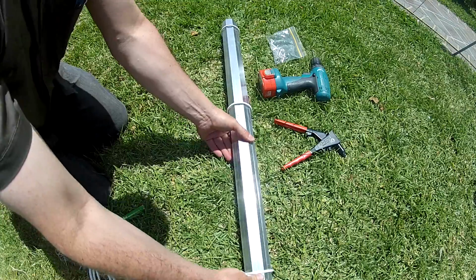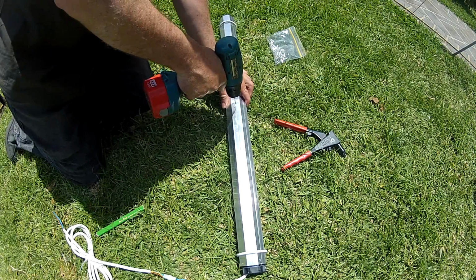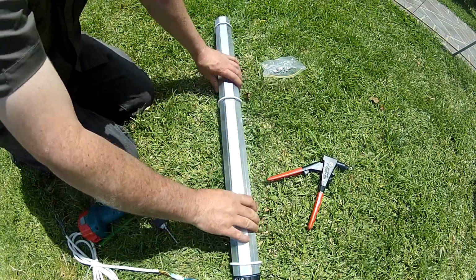You will need to drill through the aluminium and plastic with a 3mm drill bit, and then pop a rivet in position and repeat the process on the opposing side, making sure that you keep it in line to the first rivet.